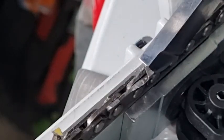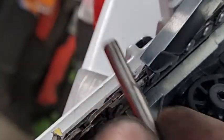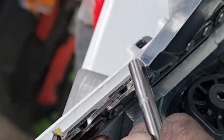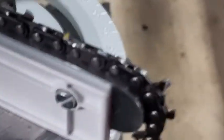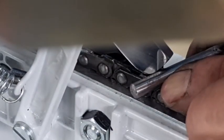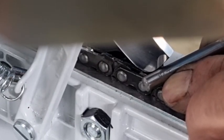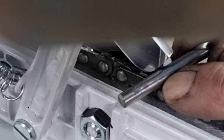The left side seems to be slightly worse than the right side, so we'll check the right side just to see what it's like for clearance. We'll put a right tooth on — there's a right tooth — and we'll get the drill again. It's a little bit hard to see on that side, but it clears. Maybe you can see it on this side. You can see the clearance there — we'll just hold that — yep, that's it. It's roughly about a millimeter clearance there.